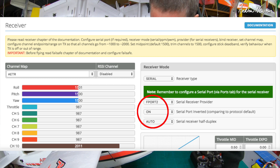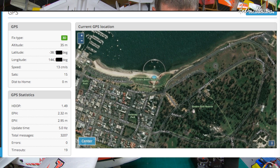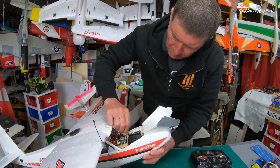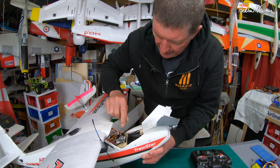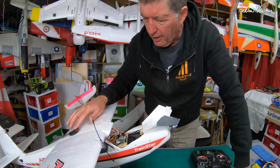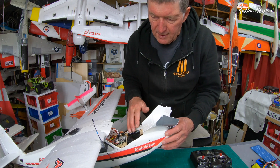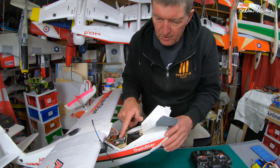In the receiver page you need to set it up as F.Port 2 and receiver. On the GPS page, just check that the total messages count is actually counting up and not sitting at zero — if you're getting numbers counting up, it's connected correctly. If it's sitting at zero, you may need to grab the RX and TX and swap them over. I've got it on a two-pin plug so I can easily do that. If you've got a blue light on your GPS, you know you're powered up correctly.